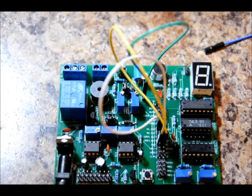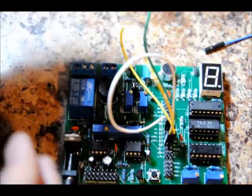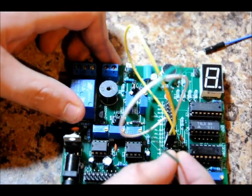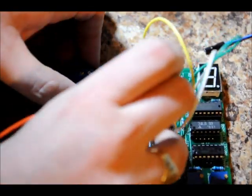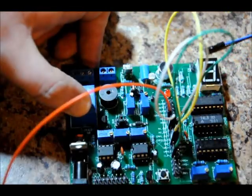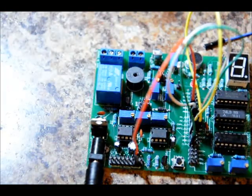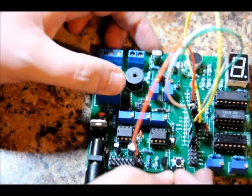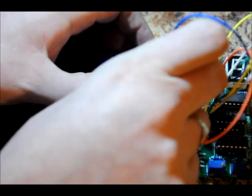If we had several pulses on the input of our counter, it would toggle it many times and leave us in an unknown state. So now I'm going to take this pin off the LED line and connect it to the clock plus input. From our diagram, I also have to take the AND1 pin — or AND2, either one — and connect it to our ground plane on the bottom. So now our counter is active. I can take the counter output, OUT A TOG, to our LED just to see it.